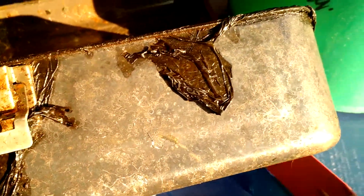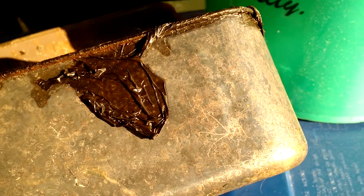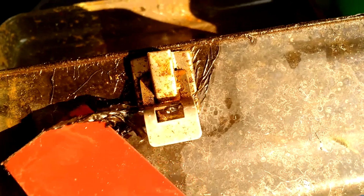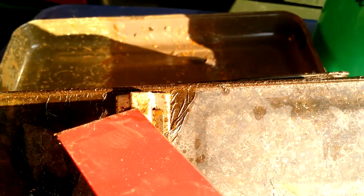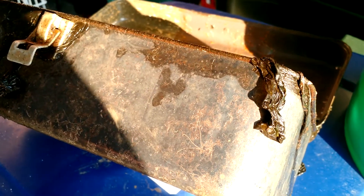When I pulled it out, it did exactly what it was supposed to. The rust usually turns gray and black, and the paint just peels right off — you're looking at bare metal. Here's some that I haven't touched, and effortlessly the paint just comes right off. If I left it in longer I can get the rust off these pieces — it'll just scrape off with zero effort. The paint just falls right off and you're left with rust-free metal. That'll be pretty easy to restore — a little prep work and a new paint job and this will look like a brand new tackle box.